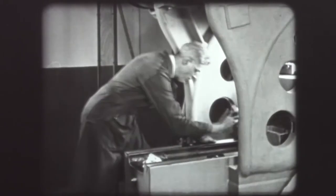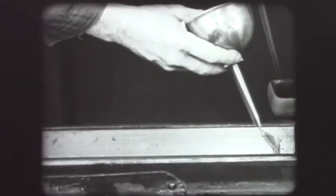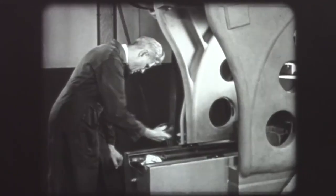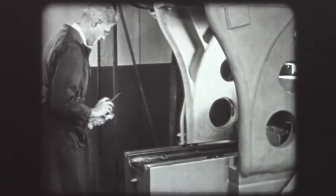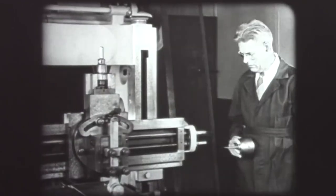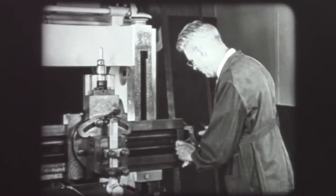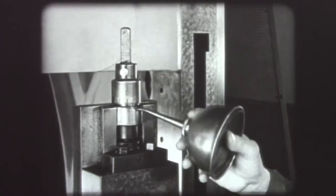Once the V-ways are clean, adding fresh oil ensures good lubrication. Also, make sure the wells in the V-ways are filled with oil. After lubricating the V-ways, check the various oil holes for the bearing surfaces, as here on the cross rail and cutting head.